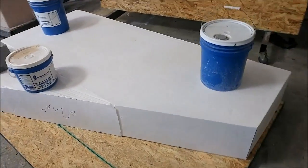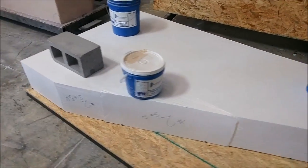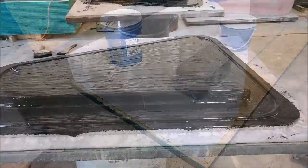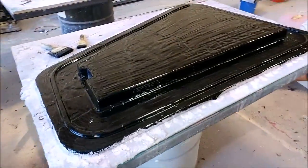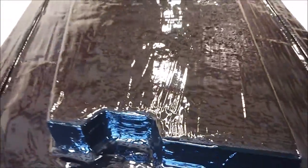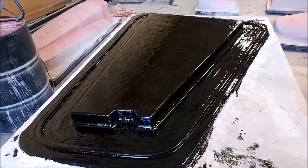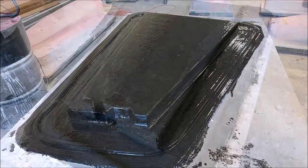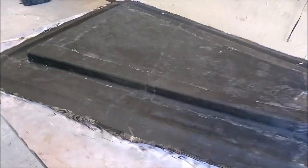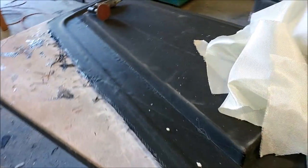The guys had the next platform ready — this is the left side upper wing strake platform ready to be milled in foam for the next round of mold making. These are the A-frames that go between the aft bulkhead and the firewall. The guys laid up the black top coat using a brush this time, as it's quicker than spraying. The next day the first layers were on — lightweight fiberglass and carbon fiber — ready for the heavy layers now.